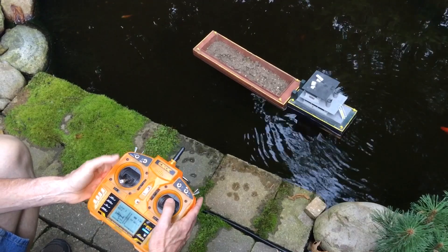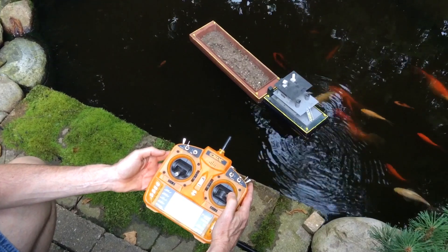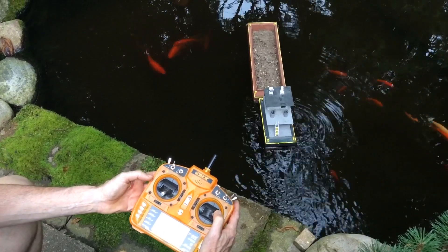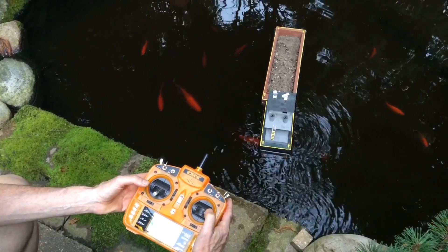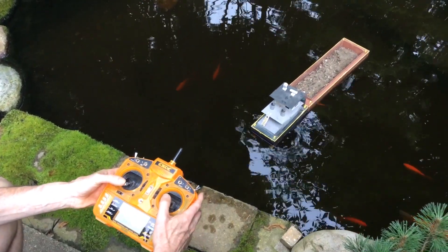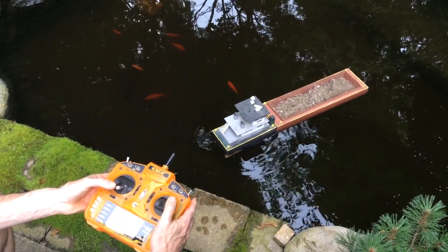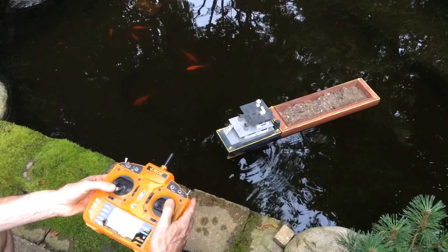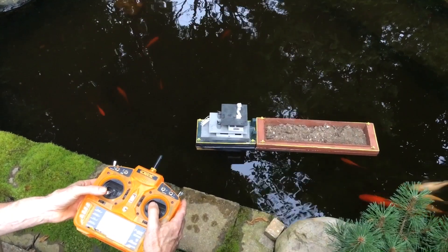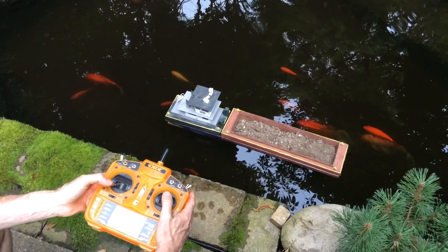The rudder is actually what's causing it to flank. When I do a straight pivot I'm just pushing the stick to the right, so one prop is thrusting forward and the other is the exact same thrust but opposite, and it pivots the barge around roughly at where the props are at the back end of the boat. To stop it from pivoting you just use the opposite rudder, and that's what causes the boat to flank whichever way — so if you push to the right with the right stick it's gonna try to pivot the front end to the right.